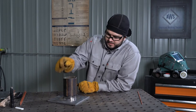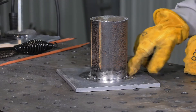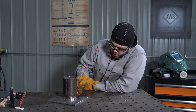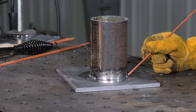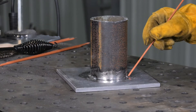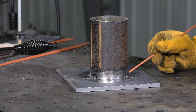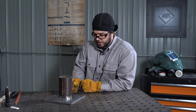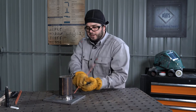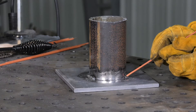The fillet weld with pipe. This is a piece of 3-inch schedule 40 tacked to a piece of 3 eighths. I've gone ahead, removed the mill scale. We're going to weld it with E6010. I'm going to strike my arc off this tack and build that weld pool up so that I'm tying in the top piece of the pipe and pulling it down to the base plate. To get the weld pool to lay the way I want it, I'm going to increase my work angle a little bit, less than 45 degrees, and make a little circular pattern moving across. Keep a tight arc. We're going around a radius here, so we're going to have to have our body fluid and moving and always changing as we fill up this weld and maintain a nice tight arc. It's going to be a challenge, but we'll get through it.